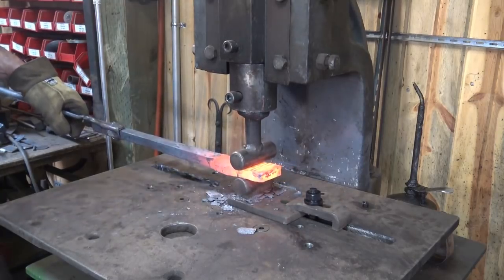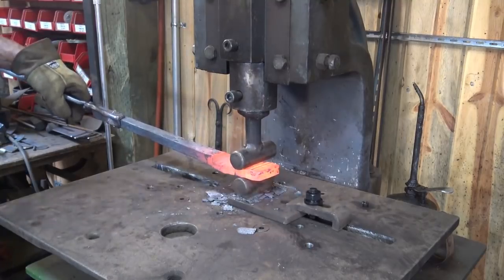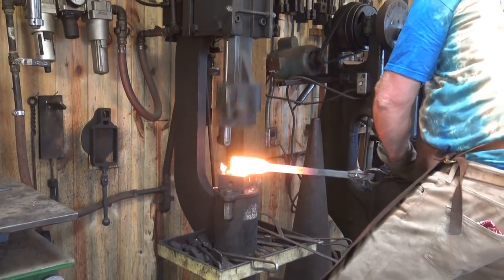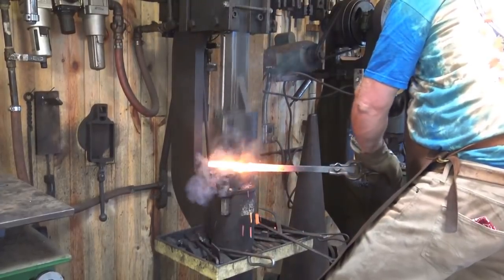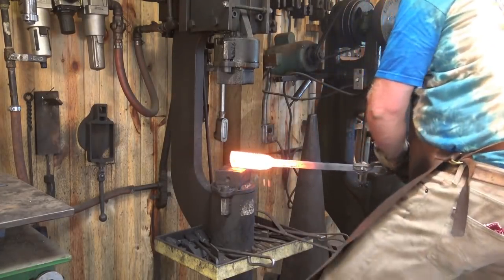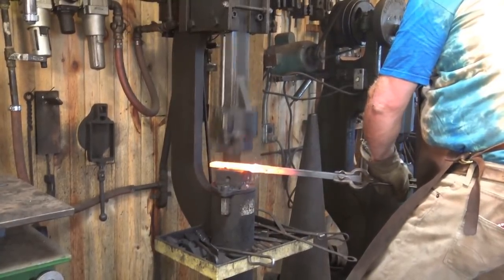This is now down to about a half inch and it's about two inches wide — it's really doing quite nicely, taking half of the thickness out and drawing it out. So let's go back to the bull hammer and clean this up. We could go back to the anvil and do it all by hand, but since we've already got power tools in the video, and since this is not as much a tutorial as it is just a chance to do something with the wrought iron that Roy sent, we're going to go ahead and use whatever tools do the job best. In this case I think it's the power hammer to draw this out a little bit more and take all those ridges out that the drawing dies in the fly press put in there.